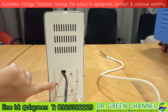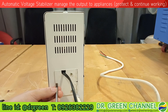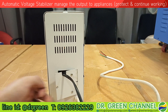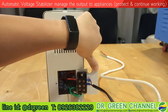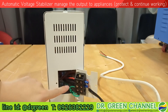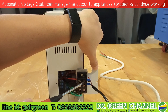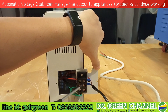You will see this cover — just make sure you loosen only this one screw, because these two screws hold the terminal inside, so don't loosen those. Just loosen the single screw on the left-hand side. I've already managed to tighten the cable inside. On this terminal you will see the label — the red one is for the phase. So the first cable on this point is the phase or line cable, and you just make sure you connect the line cable to this part on the terminal.